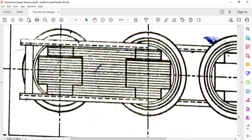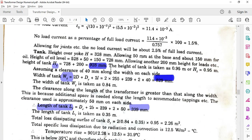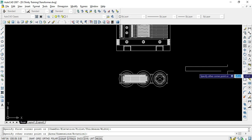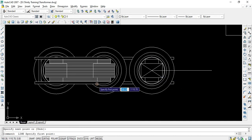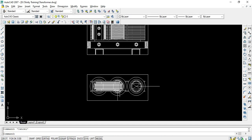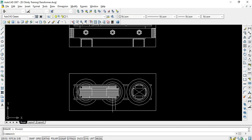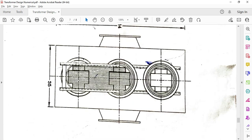In the top view we also need to draw the outer tank. The dimensions from the top view will be 829 by 339, so I'll draw a rectangle of 829 by 339. Using reference lines for alignment, I'll move it so the distance from both sides remains equal, and the top view structure will be complete.